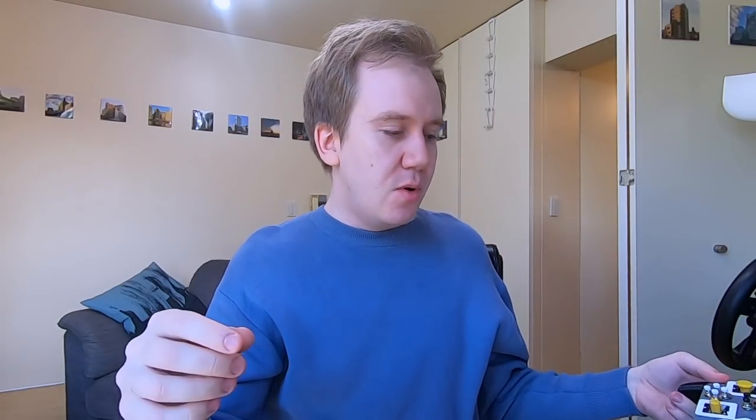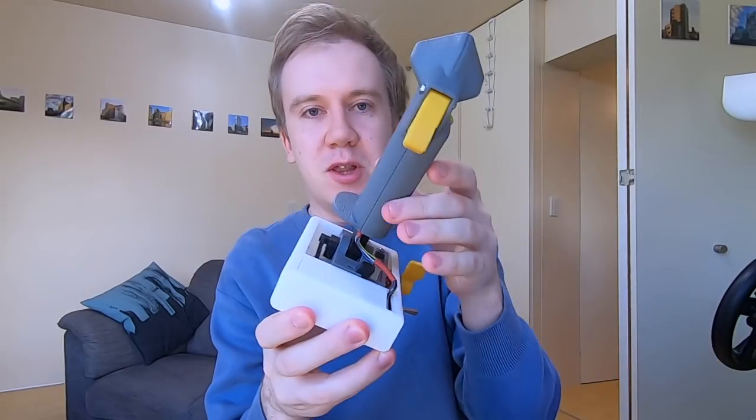First, the electronics. So to make a custom controller, you basically have 2 choices. You can get your own microcontroller, so an Arduino board or a Teensy. Wire all your switches to it and put in a firmware sketch to communicate with the computer. That's exactly what this is, right? The second way to do it, and what I've done here, is just get a cheap controller and remove the hardware and replace it with your own.